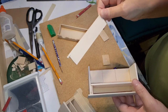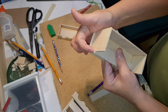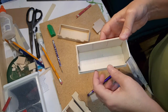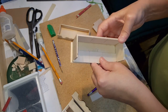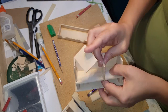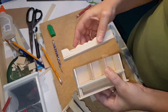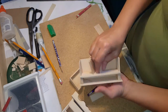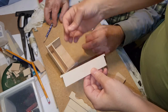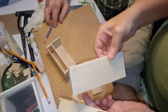Option two is to cut this piece here. You can cut it this size to save yourself some wood, or cut it larger so that it fills in the gap in the back — but it's not necessary because you'll never see that. You can use a scrap piece of wood if you have it. Once you have that cut, also cut the two pieces for your dividers. Before you glue this you need to put your holes in here with your stick pin so that you can have your door hinge, then mark the bottom and do the same thing there.